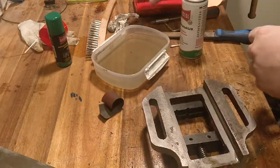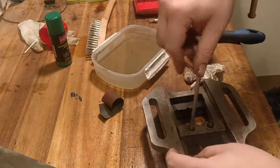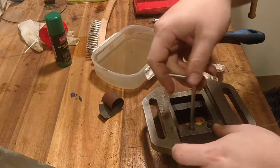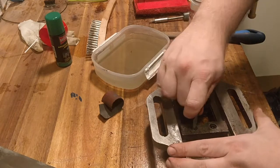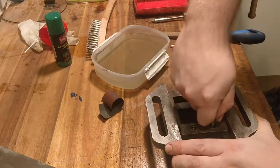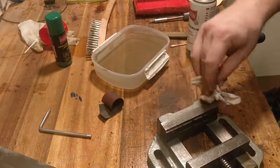You should be able to see that there is less of the red paint down near the bottom tracks, and these have also been gently lapped with a small stone, because there are also some grates in the finish. And we're done and ready to go.